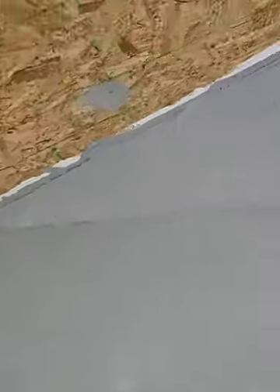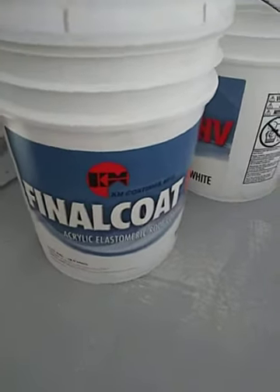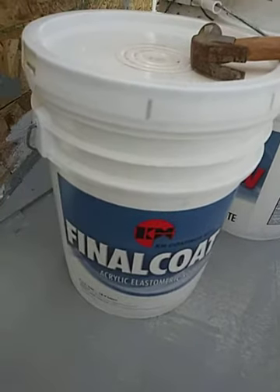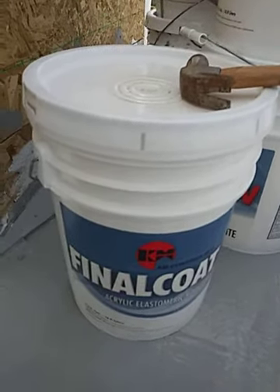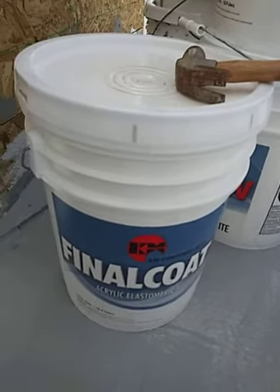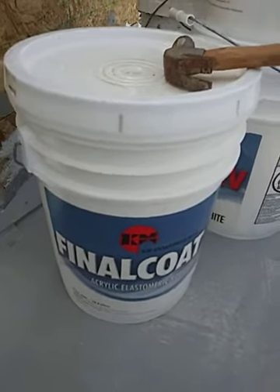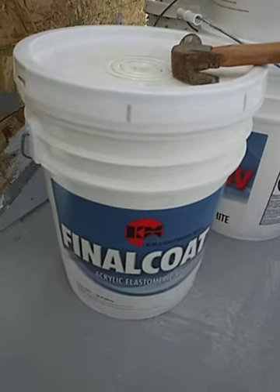See how we're filling in the cracks with the mesh — all the rain is supposed to run off that. After that's done, you put two coats of the final coat down. We haven't done that yet, we're going to get to that. This is a water-based product, so it's not as messy as working with tar oil-base. I've done tar before and I've had leaks, but that's just how it goes sometimes — you've got to make sure the hole is filled with something and then cover it with your top coat and mesh. Two coats of the final coat should be sufficient.